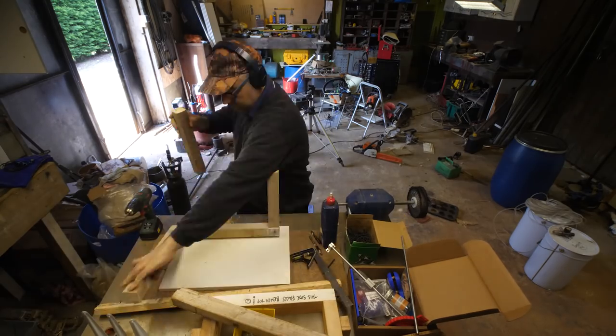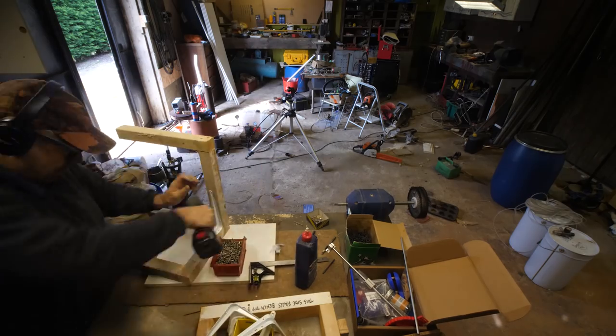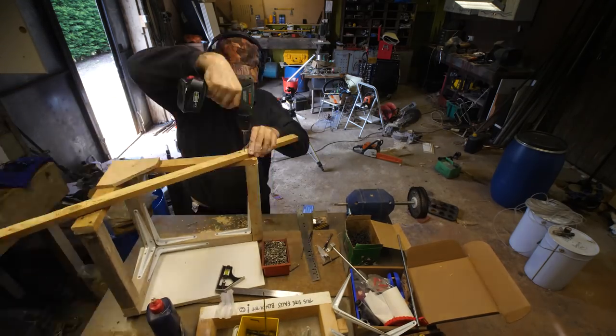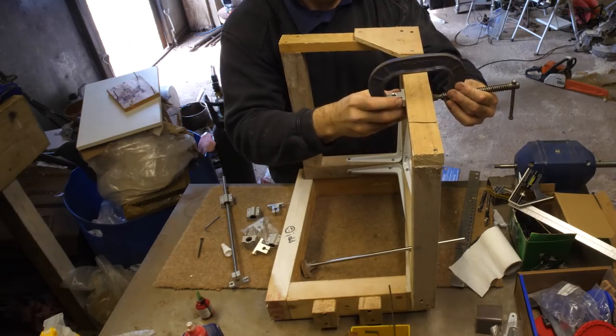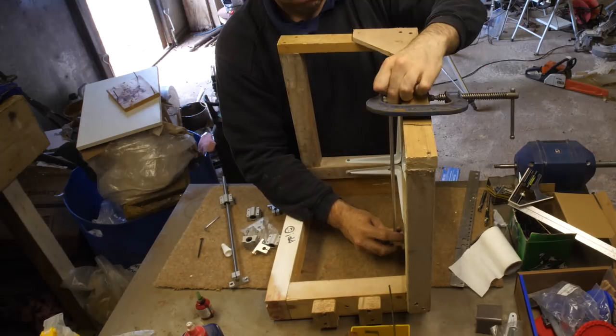I build what is essentially 2 wooden frames, but at right angles to each other. I've got some old shelving brackets to keep everything rigid. Now I have to mount the 2 rods. The main rod has three linear bearings on it, and the stabilizing rod only needs one.